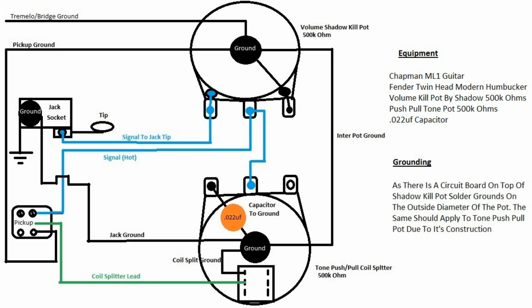Now then, when you pull that tone control out, this then connects the green down to ground, which is the top of those left-hand connectors that you see there. Now what happens here is the signal that is created within the slug coil is then, instead of being passed on to the adjustable coil, passed down through the green lead down to ground. Hence, it basically switches it off. So the only coil that you will hear is the adjustable pole coil, the one with the straight head screwdriver slots in the poles. Okay, so that's basically how that works.